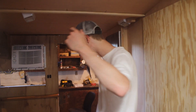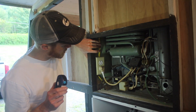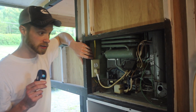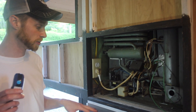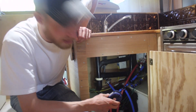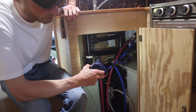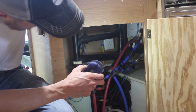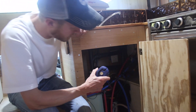The first circuit starts out here, goes up through the walls. It feeds this receptacle, which is specifically for the fridge — the AC electrical portion of the fridge, which is 120 volts. Continuing on the same circuit, there is a GFCI receptacle for the AC heater on the water heater. And that's the end of that circuit because that pulls about 1,200 watts.